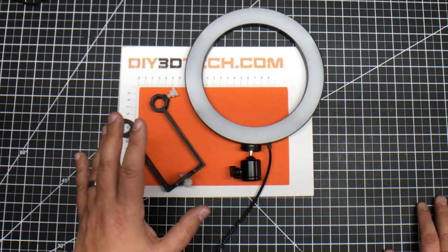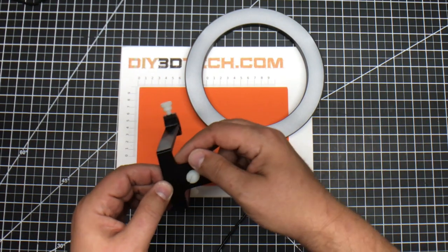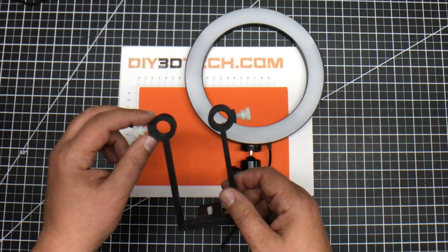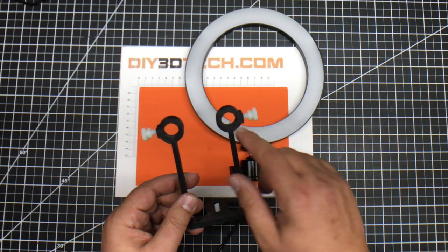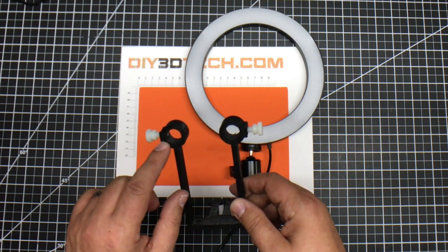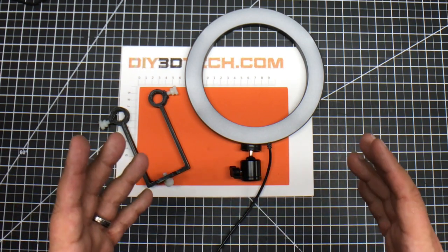One of the big things I love in Fusion 360, outside of threads, is fillets. You can see here how I've built in fillets for strength, and down here how it's rounded — very strong. I also built up extra area around the quarter-20s. The 5 millimeters I had around there concerned me that I wouldn't get a good cinch and might pull the threads out, so bringing it up to 10 millimeters works like a charm. These are things to think about when approaching and solving a design problem.